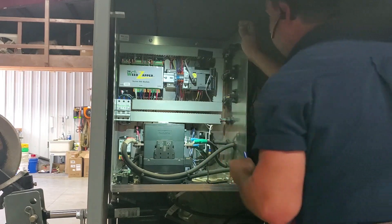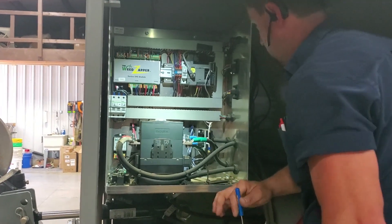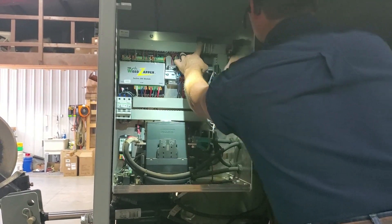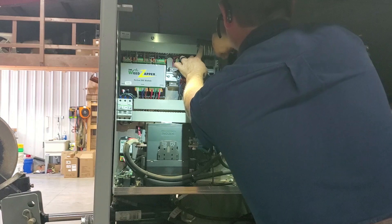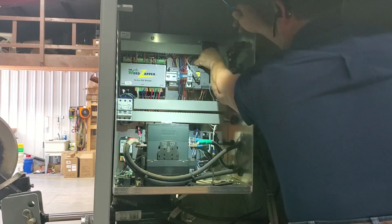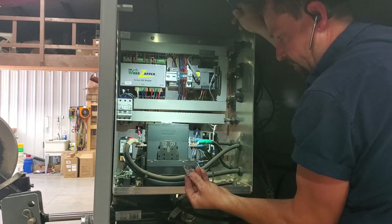Now the next part is going to be kind of hard to see from our camera angle, but we have a close-up coming in just a second. So you can remove that top terminal strip of wires, then reach in here with a small flathead screwdriver. Pop your battery out — there's a close-up coming. I just want you to see you can do this without removing the whole unit. There's our battery; it slides right up out of there.